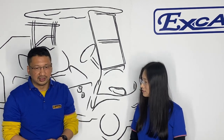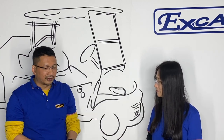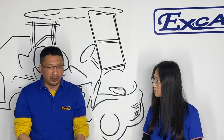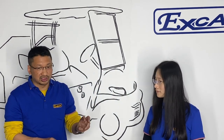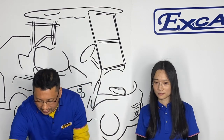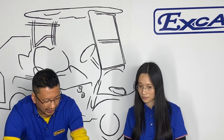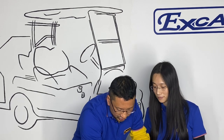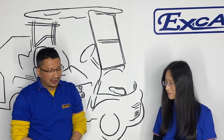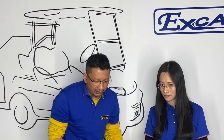How do we start the charger? The start signal is not only from voltage — it also comes from the communication cable. When the charger receives AC power, it will communicate with the BMS automatically, and the BMS will engage the solenoid to start charging. Let's demonstrate: first, plug in the AC power, then plug in the communication cable — you'll hear a click sound. Then plug in the indicator. Now it's charging.